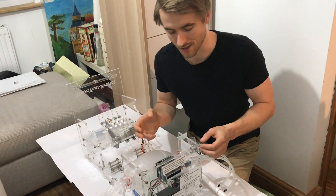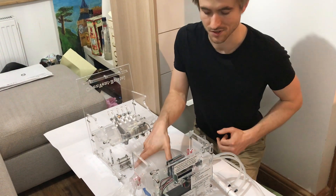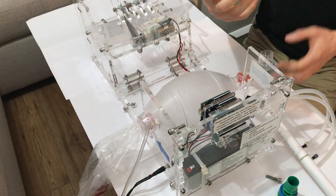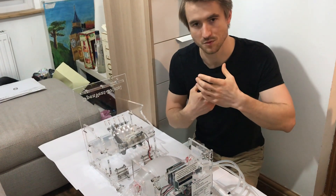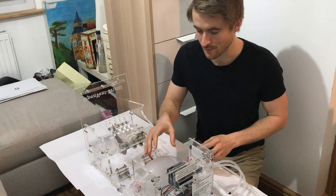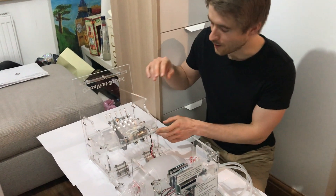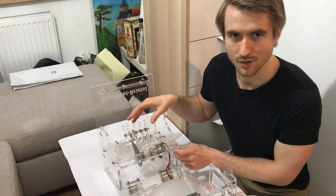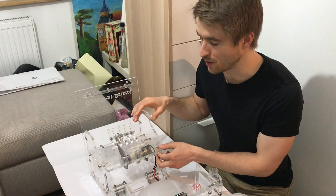The one thing it can't do already is automatically ventilate — it's designed as a hand pump ventilator. You squeeze it, and traditionally a paramedic would put a mask on the end and squeeze it as a temporary measure. What we're doing is animating and actuating that bag using an electromechanical mechanism, while still keeping it as simple as possible. There's nothing fancy — no parts that don't need to be there. It's cut down to the absolute bare bones.